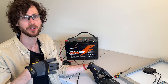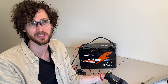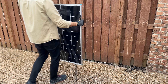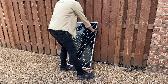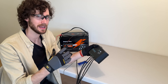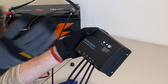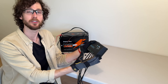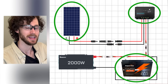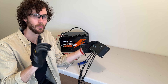For the magic to happen, we're actually going to take the solar panel outside and put it in a sunny spot, even if it's not that sunny — or in my case it's just later in the evening, you'll probably still see what we're about to see. Put your solar panel outside if you haven't already, then come back inside and look at your charge controller. As you'll see, mine has a light that has started blinking — it's the PV light. PV refers to solar in this case. A blinking PV light means that everything is properly connected and the solar panel is safely charging the battery. The second connection is done — we just have one more to go.